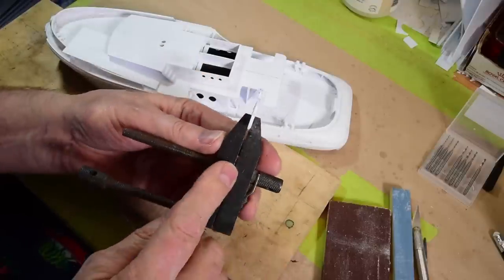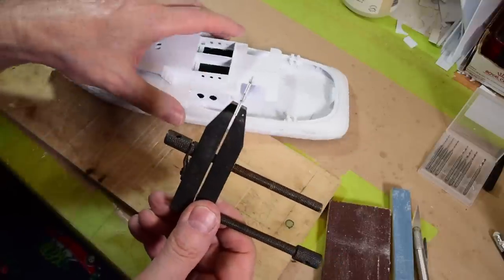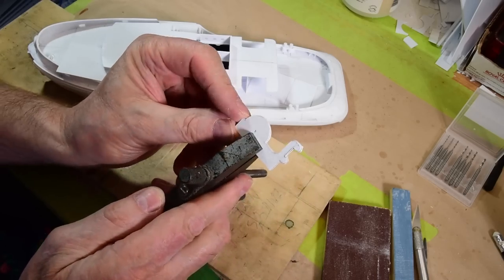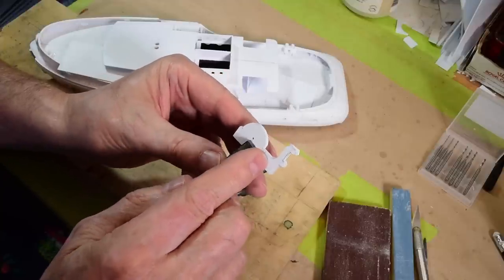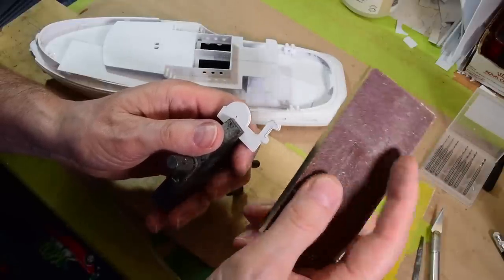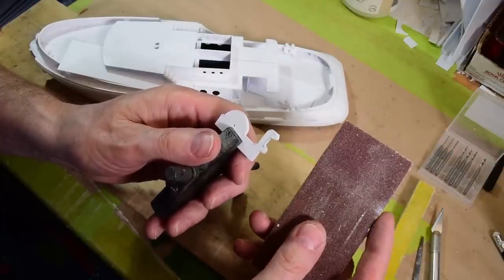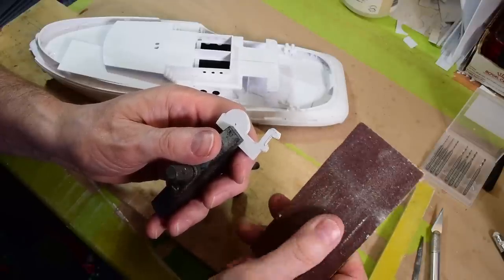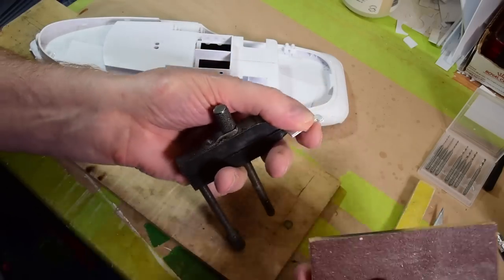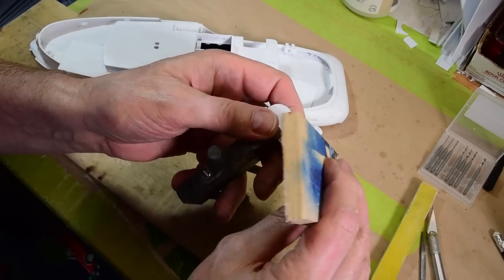A couple of tool tips: you should try to get one of these little machinist clamps — they're a must in this game. I have two of these templates and I've clamped them together so I want to file them together, clean them up so they're both exactly the same. And here's another tip: I have a lot of these sanding sticks — make up some with emery cloth as well. With plastic, I use this to shape parts all the time. I'll grab anything on my bench; a file is great, but I'll use this to do little rounds.